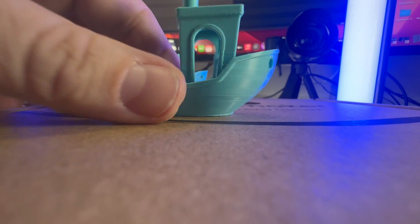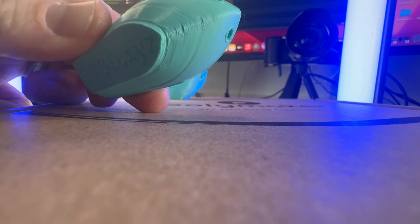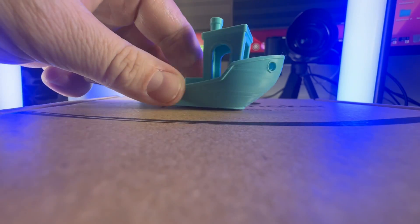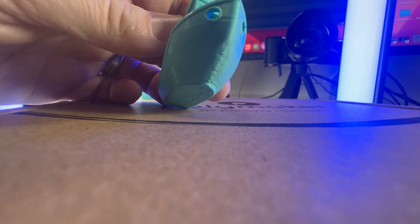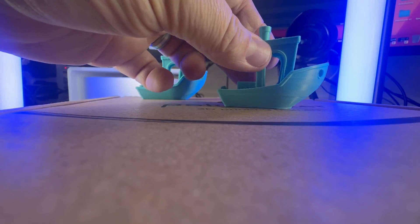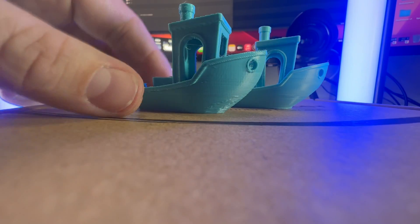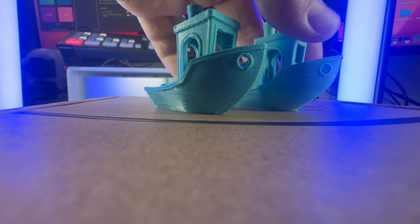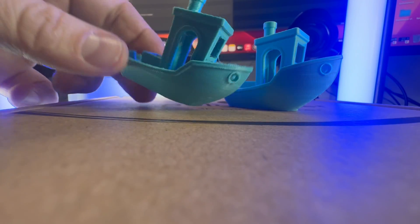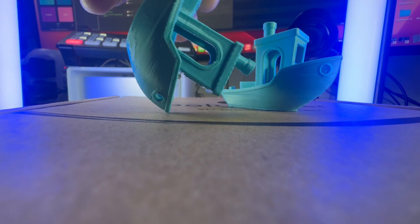The print on the right is not perfect — it's not the best Benchy I've ever seen — but you can certainly see there is a clear difference, and I believe that's all down to the input shaping. We sped it up a tiny bit, and there are some lips and bits in that print, but overall the right-hand boat printed in PETG from Polymaker is so much better than the left. Input shaping is really just one thing you can look at to tune on Klipper. Pressure advance and rotation distances are something I'll be looking at next to obtain better print quality. If you want to see those kinds of videos, make sure you hit like and subscribe.